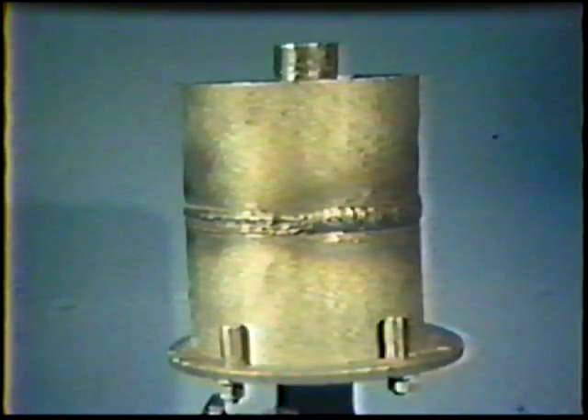For this exercise, prepare a set of test nipples and then weld them with the procedure and technique outlined in topics 12 and 13. Three-fourths of the pipe should be welded in the 5G position and the remaining fourth in the 2G position. The first or root pass should be completely welded in both the 2G and 5G positions before the additional passes are made for each layer.